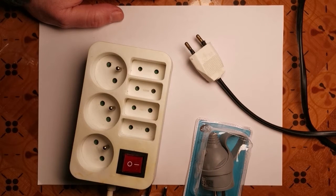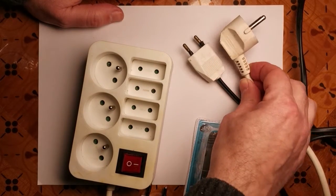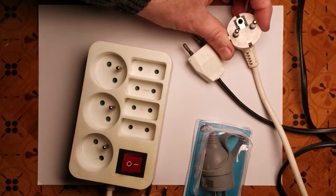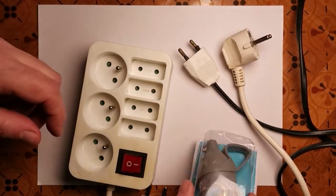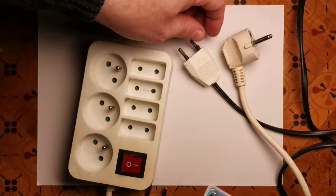What I'm going to do today is just change the plug from one of the 6-amp types to one of the 16-amp types. It's not an earth device so it's not going to be using the earth pole, but it's obviously got much better construction — the pins are pure metal all the way along rather than this plastic sheathing which melts if it draws too much current.